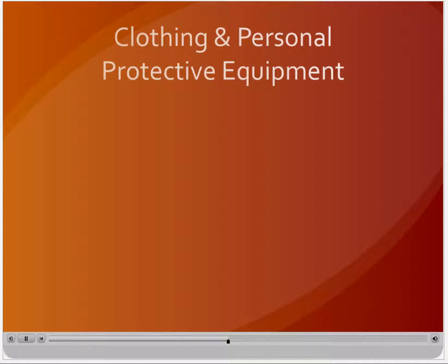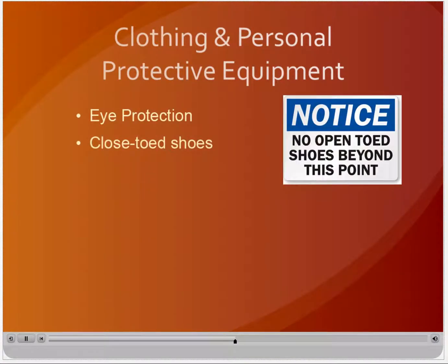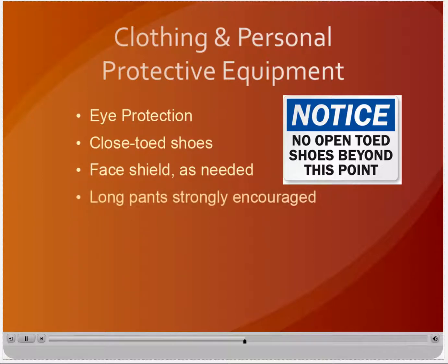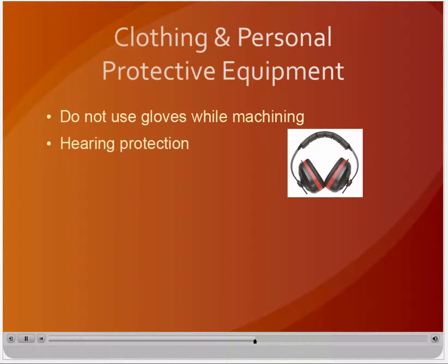Standards for personal protective equipment, or PPE, have been established based on the hazards of machine shop work. Eye protection in the form of safety glasses or goggles is required when equipment is in use. Closed-toed shoes are required for work in machine shops — individuals in flip flops or sandals will be turned away. For certain pieces of equipment such as grinders, additional face protection in the form of a face shield should be used; however, face shields do not take the place of eye protection. Because of the potential for flying metal shavings and sharp edges, long pants are strongly encouraged. A variety of hearing protection is available in each shop. Ear muffs or ear plugs should be used when exposed to loud equipment. Be sure you know the proper way to wear hearing protection — ask your shop supervisor if you have any questions.